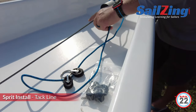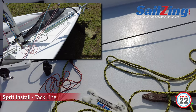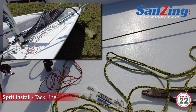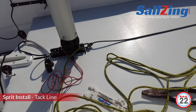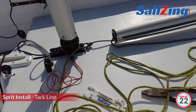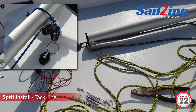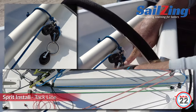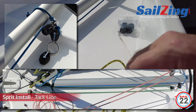Now we do upgrade this to a piece of Dyneema. Lighter and heavier are going to be different. Lighter, you're going to need to let it breathe a little bit, where heavier, you want it as tight as possible. So you'd be able to adjust that a little bit. And then it'll come in on its own with the dousing line, because it's attached to this. As the kite comes in, this wants to come forward. And just make sure this is not twisted here. See how these blocks are this way, because this one doesn't twist. This one does twist, this one doesn't. So see how that is. And then the spinnaker halyard will come through here and then that way.